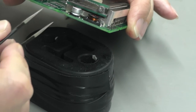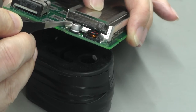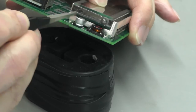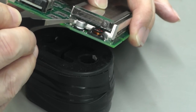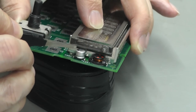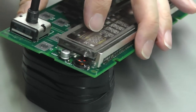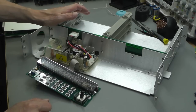Well, as I was concerned about, this end capacitor just gets touched by the glass. And the glass has got about another millimetre to drop, so I'm going to have to change out that capacitor. Either that or I can offset it slightly. It's only just caught by the glass, so if I just shift the capacitor towards the edge of the PCB very slightly, I should be good to go, I think. Okay, I think we're ready for a power-up.